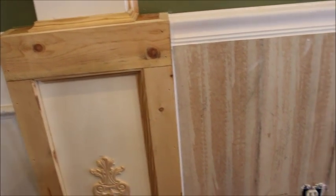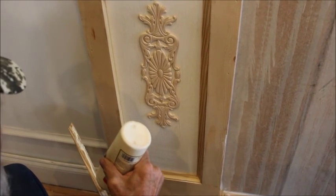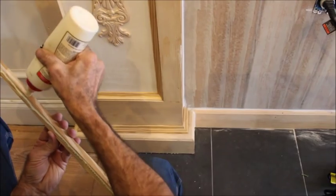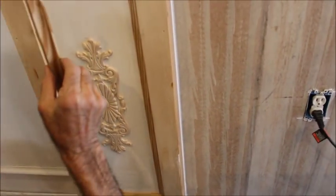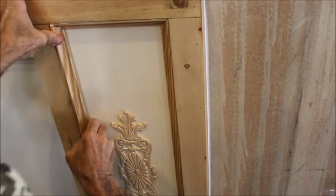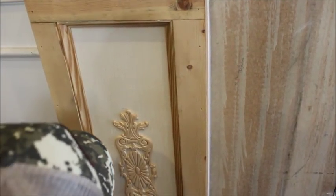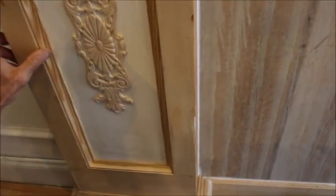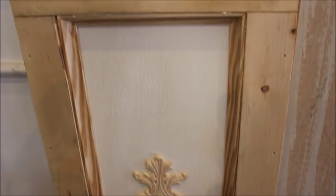You can see I wipe it off so that it's not exposed anywhere. If some gets on something that you're staining, you can use a damp rag to clean this particular type of glue off. You can see I'm putting the inside Scotia molding in — this is part of the trim work that goes with these columns, and I've designed these columns to match the two front columns. When you come in the front door of my house there's two columns on each side of my foyer with this exact same trim on it. You notice I'm bowing the piece of molding out here because it's extremely tight — I have to kind of take my hands and tap it in because I don't like having gaps. I like it to fit precise. It looks like it's going to work, so we'll show you up close what it looks like — we've got the inside Scotia around the pedestal and around the top part of the column also.